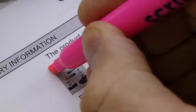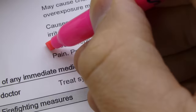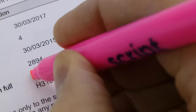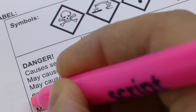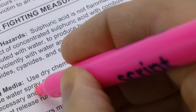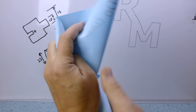Before I do anything with any chemicals, here's a disclaimer: sodium hydroxide and sulfuric acid can both be very dangerous. You need a tidy space to work, gloves, eye protection, and old clothes — trust me on the old clothes, the acids cost me two pairs of jeans so far. When making up the solutions, always add the chemical to the water, not the other way around.